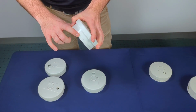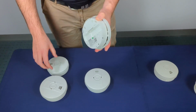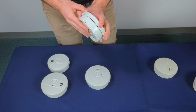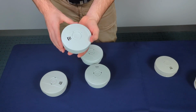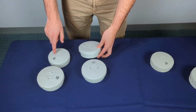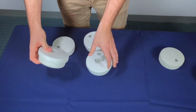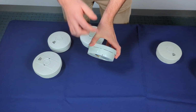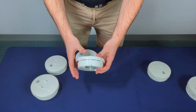We'll find an alarm and double press the link button. So it's either the link button on the wireless base, or the top button on a DCW. Once you double press the button, it'll start the flash, and every alarm in the network will begin to flash as well. And this is what's called the open network. So every alarm will begin the flash, and what you should do is go to every single alarm and make sure that they are all connected or all open.